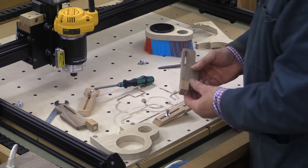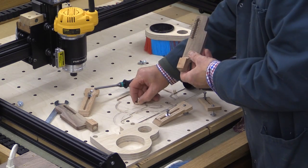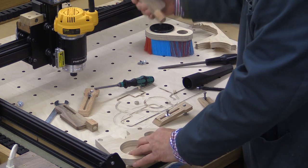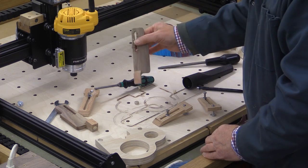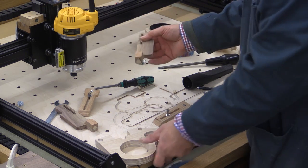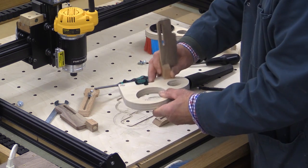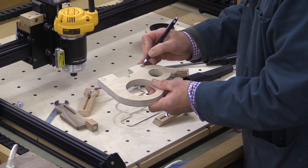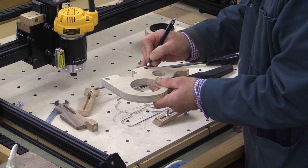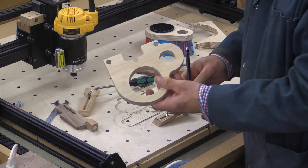Now it's really important to make sure you get the magnet polarity right at this stage. I've already done the left-hand one, but for the right-hand one I'm going to get that attached, just like so. I'm then going to push the magnet into the hole and slide it off. Now I'm going to make a little mark on here so I can be certain when I take this magnet out that I've got it round the right way.